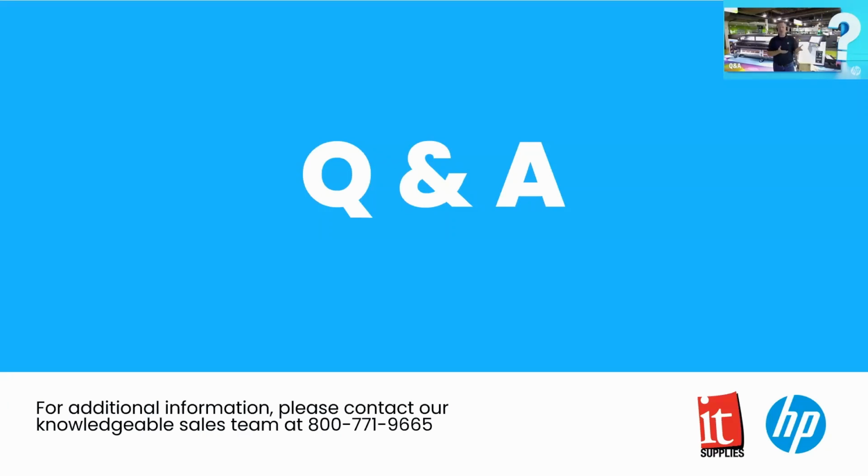If you're printing to just polyester and it needs to have a high level of durability, I recommend printing to dye sub, right? If you're going to print for something that needs to have UV resistance, then pigment printers are the way to go. There's another caveat though, and that is naturals. So if you want to print to a burlap bag, if you want to print to a canvas, a cotton, a linen, something like that, you can't sublimate that. You can't dye it. The only thing that you can use dye on is polyester. It's the only thing that will open up and receive the dye gas ink.